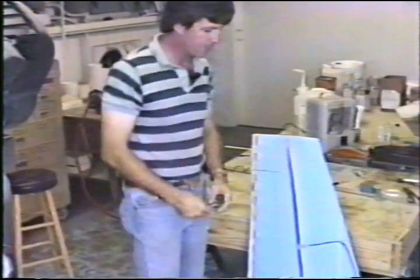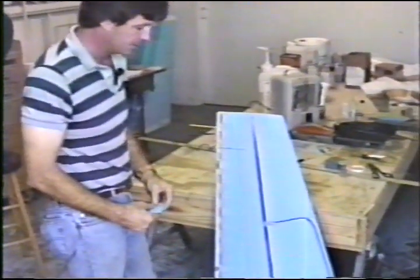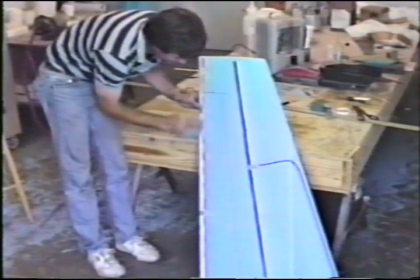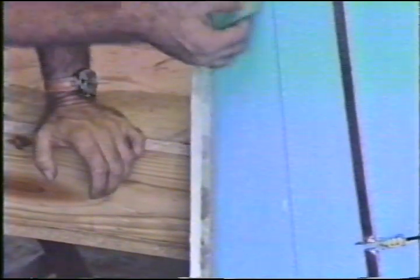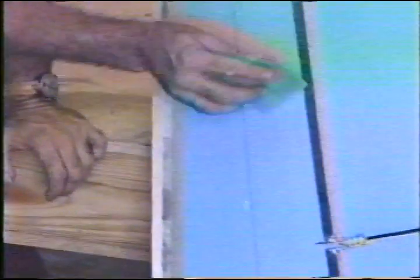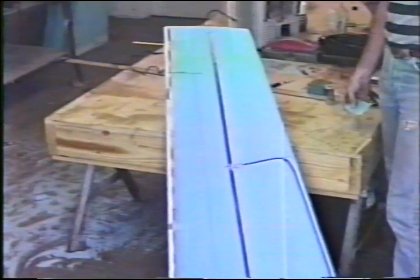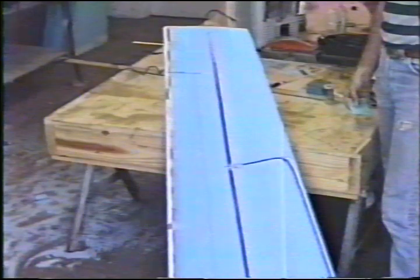One last overview before you laminate this side. The preparation necessary prior to glassing is that your trailing edge glass-to-glass area, after you've pulled the peel ply, needs to be sanded with 80 grit to expose the glass filament itself, endeavoring not to bump or damage your foam. The layout of your rudder, the attachment of your foils, the soldering, the fitting of your coaxial, as well as what we showed you earlier, the sanding of 1.5 to 2 inches of your leading edge, as well as the tapering of your leading edge. Next application will be slurry and the 4 plies of glass.